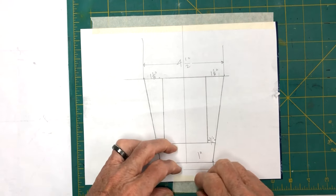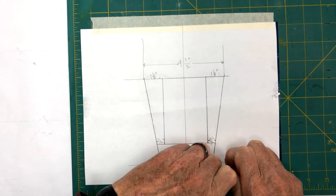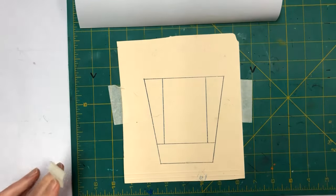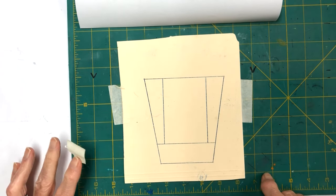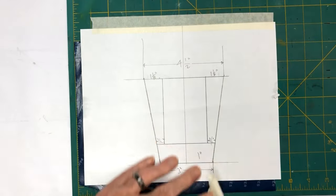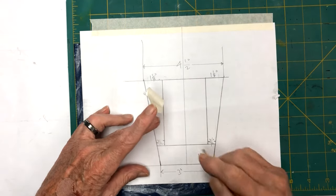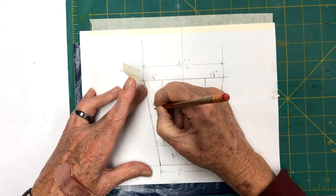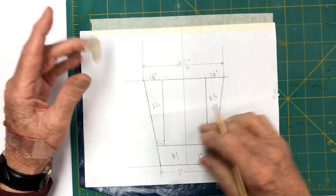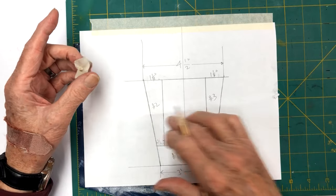There's our pattern. We'll take this back and I'll show it to you real quick - then we'll cut it up and get ready to cut some glass and make these up. Here's our pattern right here. One other thing - let's mark these. This one will be number one, this will be number two, this will be number three. The reason we're marking those is because if you cut them all doing one side, they won't fit on the other side. Even though these are going to be the same size, you want to be able to make a left-hand and a right-hand one.